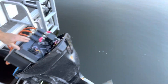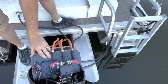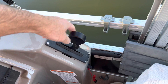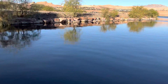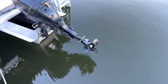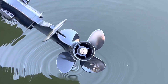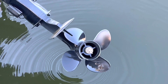I went with a four-blade prop on this just because it's pushing a heavier boat, and about 60 horsepower equivalent. We were able to go higher current due to the ability of the battery to deliver that kind of power. The lower unit is a bit too small for this type of load — really it's like the lower unit from a 30-40 horse motor. This is the largest diameter propeller I could get on here for the most blade area possible, so it works fine but probably not as efficient as a larger prop would be.